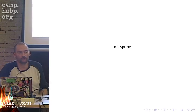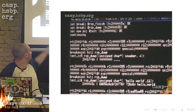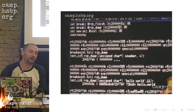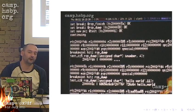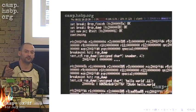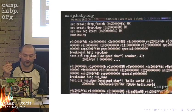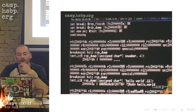I also want to show something more positive about this project — two things that are offspring of it. One was presented last year: PyRSP. It is a scripting tool with which you can debug ARM CPUs via JTAG and SWD. It allows you to script tests on hardware, do a kind of fuzzing as well, unit testing, etc. It's a really exciting little tool if you work with embedded ARM CPUs, and it makes life and development with Pitchfork much easier.